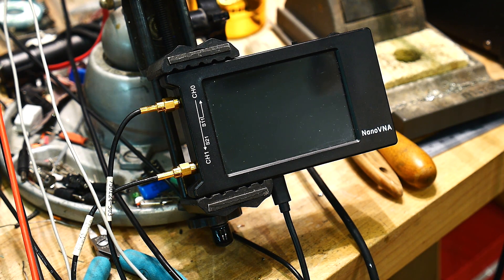I got curious about how the NanoVNA outputs its signal. I know it uses a direct digital synthesis chip, or some variation of that, to create a signal. I'm led to believe it outputs 0 to 300 megahertz and relies on harmonics to get up to 1.5 gigahertz. I'm curious to know what the signal integrity is on the output connector of channel 0.